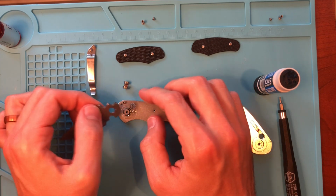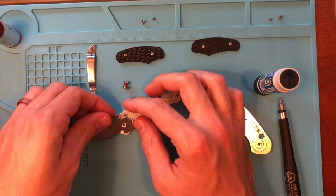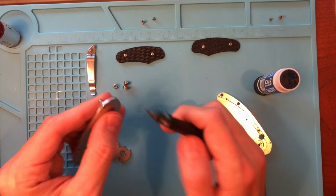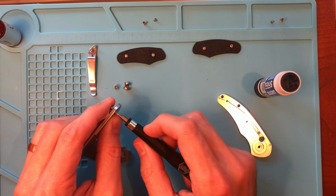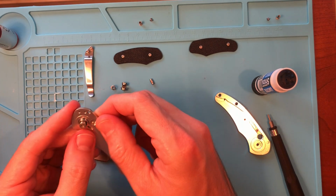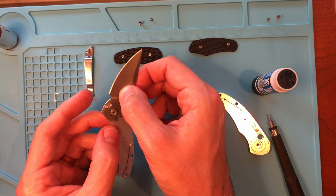And so now you're going to want to take your blade, and I'm realizing now the mistakes I have made. I think last time I did the same thing. I want to take this stop pin back off. So there you go, learn from my mistakes. Don't put the stop pin on first. Start with the blade and leave the stop pin out to give yourself enough freedom there.